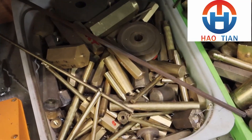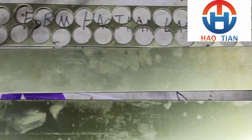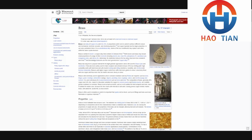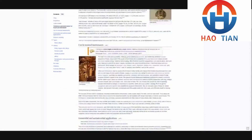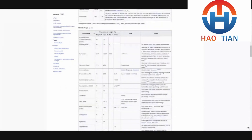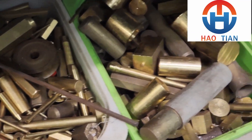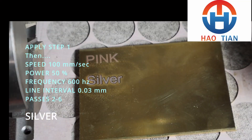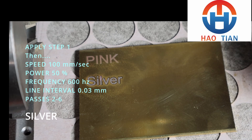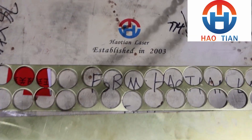So let's talk about the material. Brass is brass, right? Well, no, it's not. I work with brass a lot — over the last 25 years I've probably handled many tons of brass. According to Wikipedia there are approximately 30 common alloys of brass in use. Will my process work the same on the alloys you have? I have no idea, but it does work slightly differently on the two alloys I use in my shop: alloy C26000, which is 70/30 brass, and alloy C38500, which is free-cutting brass. They're very common alloys and if you use these the process will definitely work.